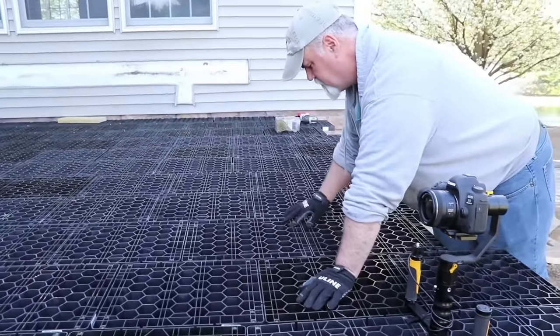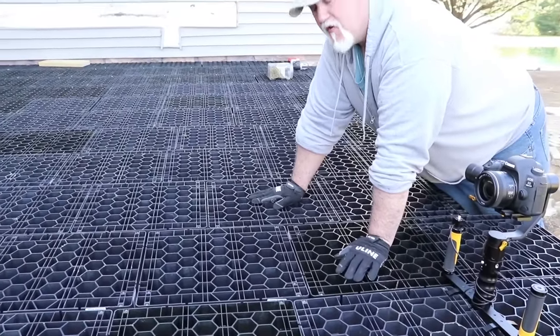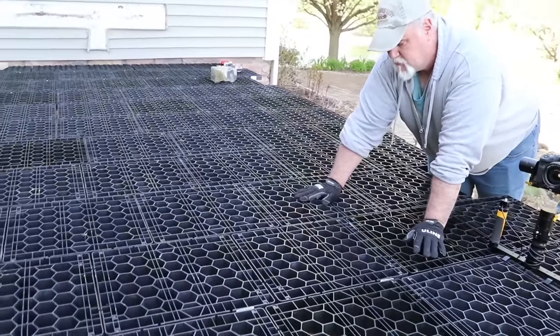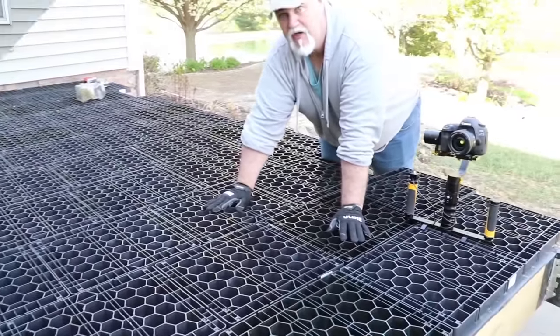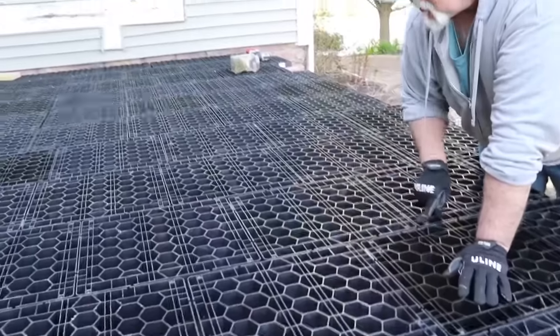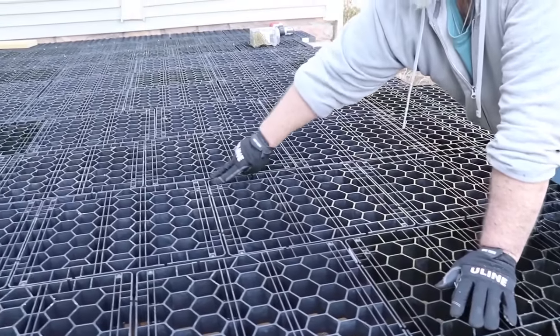Basically brace straps that go across the back. This provides side-to-side strength when you push down on it. It does flex. It's designed to flex. If it didn't flex with the freeze thaw and the movement of the deck, it'd break. But the strength here is from here to here. To go this way, these are the most important things, these lines right here to strengthen it.